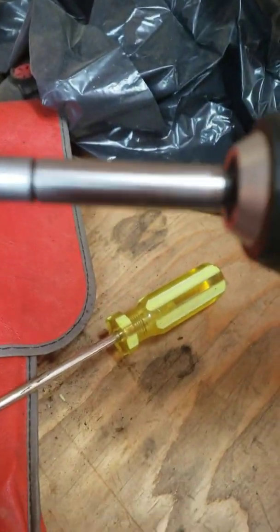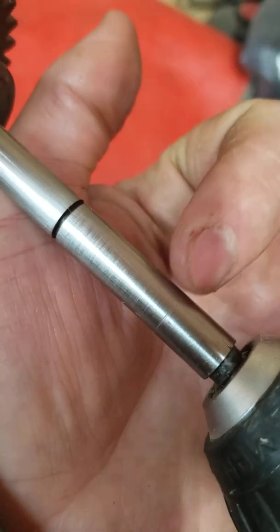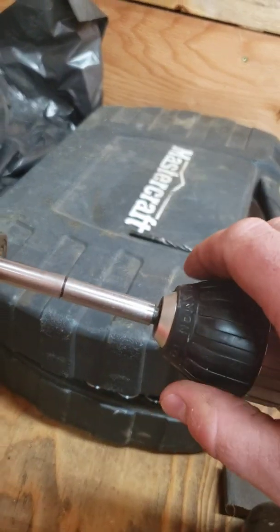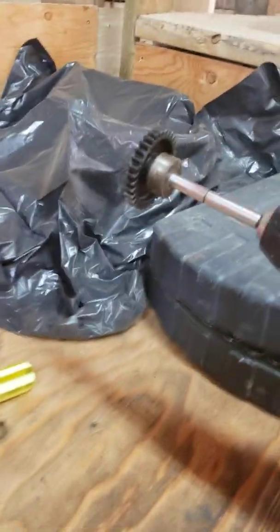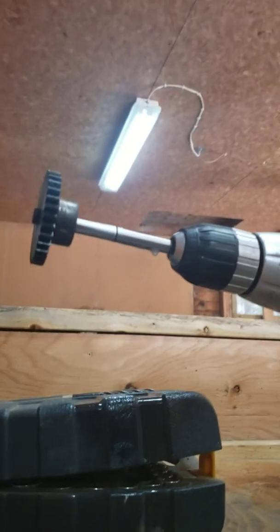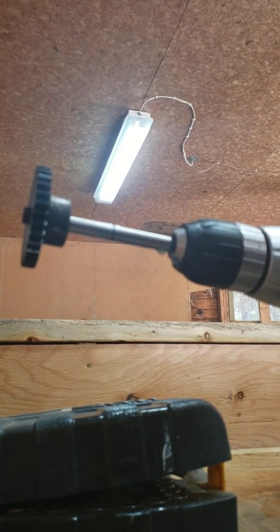One thing you have to check is that the seals have a tendency to mark the shaft. You can see there's a line right here - that's where a seal's been riding and it's actually cut into the shaft. If the grooves aren't too deep, you can resurface the shaft. That's why it's chucked in a drill here. Just chuck it not too tight since you're gripping the threads - just enough to spin it. Put some WD-40 on the shaft and get some fine emery cloth.